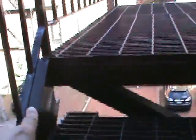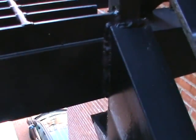So everything is all welded. As soon as you pop a bolt into some of these things, you know, the welder is not a certified welder. This is a single bead on a structural weld. So put a bolt here, put an angle clip here with some bolts. We start eliminating a lot of these welds by going to a bolted connection.